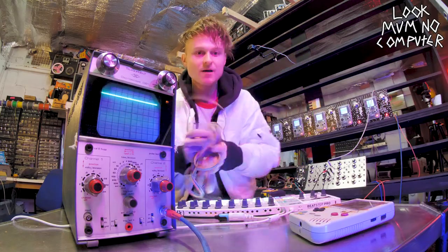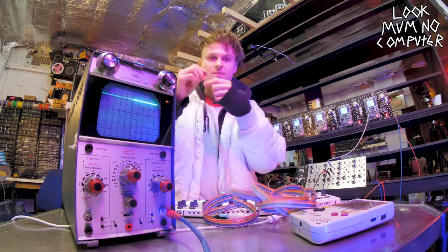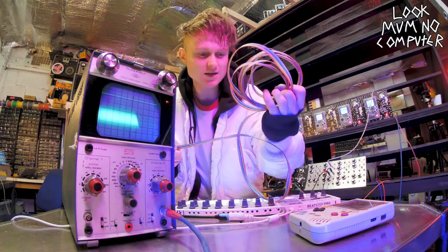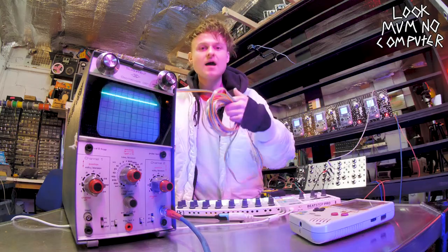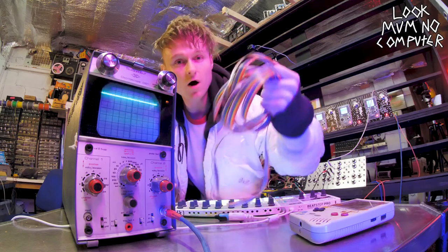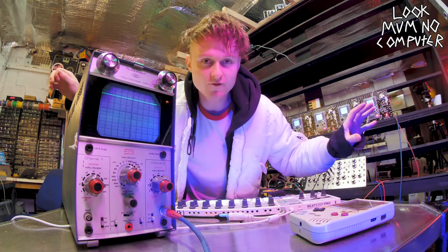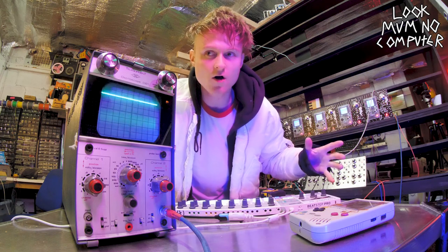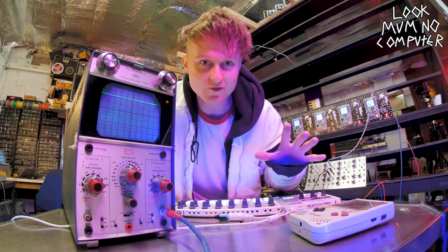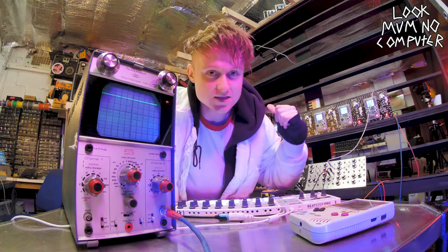These have changed my life. Instead of having to make my own wires, these things are able to just connect between the Game Boys using the little connectors. They are a little expensive — I had to spend quite a bit of money on these things — but it's a necessary thing because it saves a lot of time. However, these brought up so many problems. They're a lot thinner, I need a lot more of them, and it started creating a lot of weird signal noises, making the Game Boys go mad. I wasted about five days trying to work out what went wrong, and it basically made me go back to the starting line.